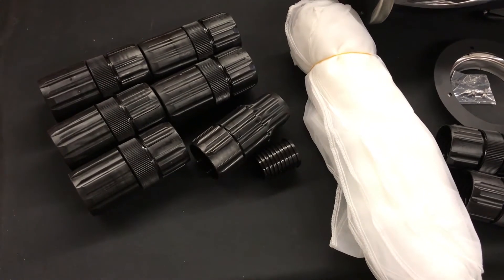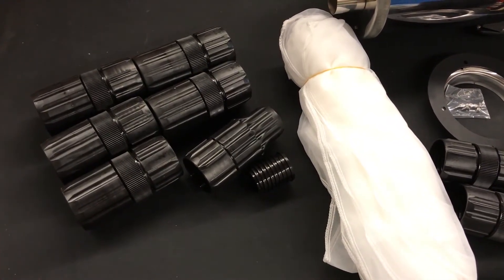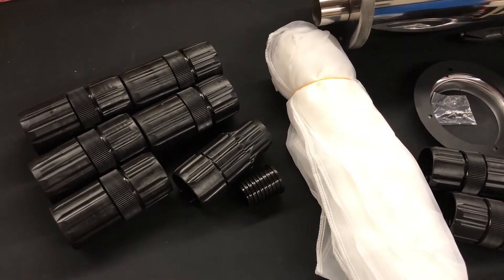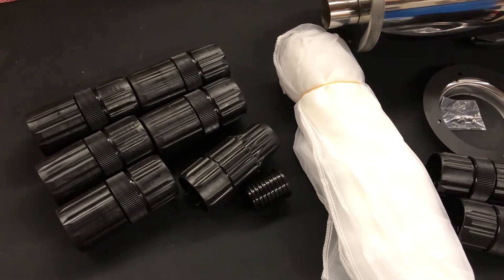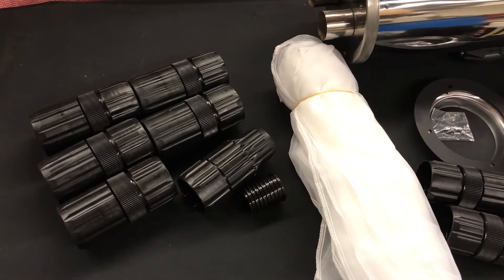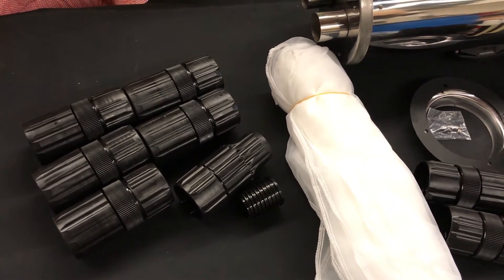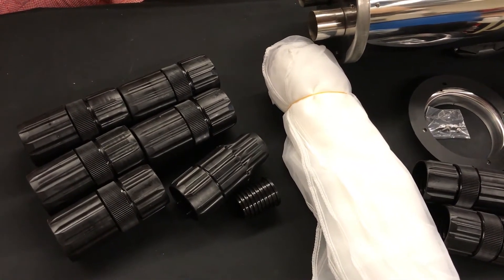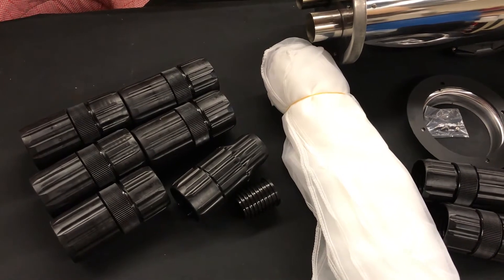So I'm always telling guys: get rid of your whip hose. 'Yeah, but my 2-inch hose is so stiff.' That's because you're buying your 2-inch hose from a regular supplier. Hardly any of them — in fact, I only know of one — stocks the little better vac hose. This is the hose that evolved from cool cuffs. We needed a better vac hose, we already had a better hose cuff but the hose had to be improved. Amflex stepped up, modified their hose to work with cool cuffs, and went beyond that — making it better until one day I said let's call this the little better vac hose, because it is. It's got an inner liner of titanium dioxide which radiates heat inward away from the body of the hose so we can use a softer polymer for the plastic. So why don't suppliers have it? Because they can't double their money. If they can't make enough money, they don't do it.